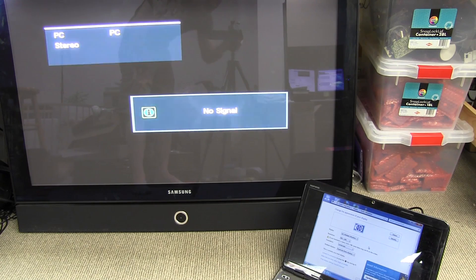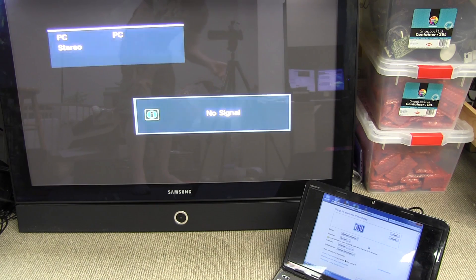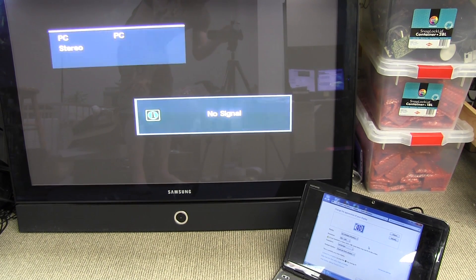I've turned off the blue screen mode, and no — the PC input does not work. I've set it to the lowest resolution possible, 800 by 600. If it can't do that, seriously, it does not work. So the VGA input is definitely cactus.